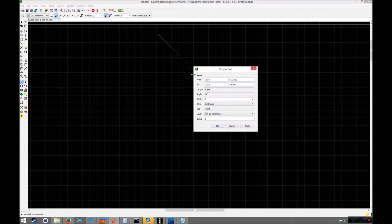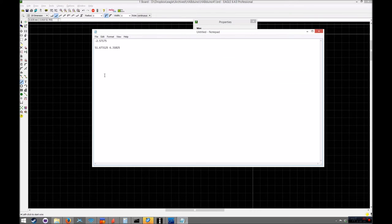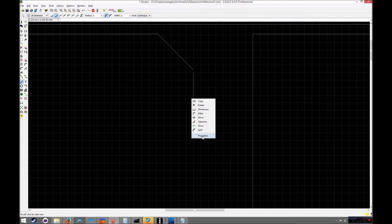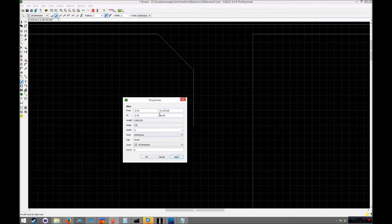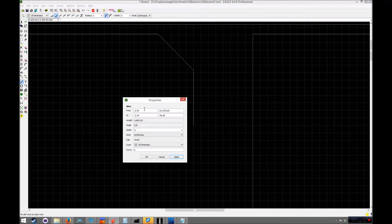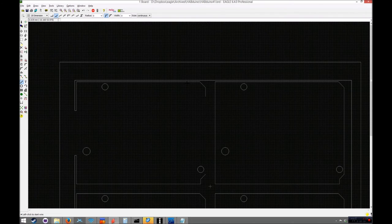And that needs to match up now. So it's going to be at 51 on there, and the X is going to be there. So that's now matched up. It's very important you get those matched up. If you don't, you're just going to end up with problems.